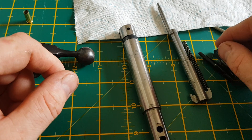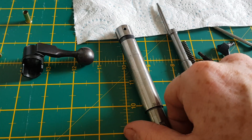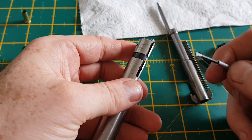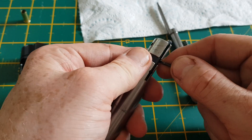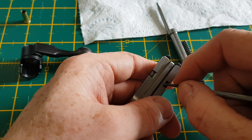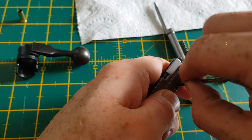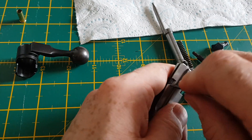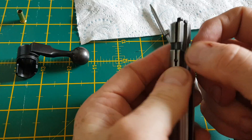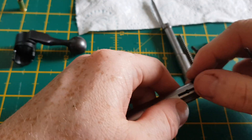So that pretty much is the components. Now to do the last bit is a little bit awkward but not too bad. You just need a thin precision screwdriver to get in behind this retainer clip — it usually just pops off. It is quite tight, but if you can get in behind it with a little bit of force, there we go, and the retainer clip comes off.